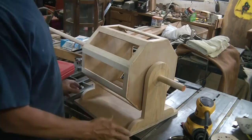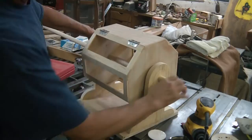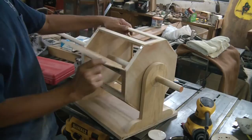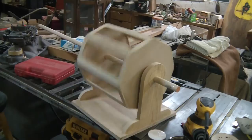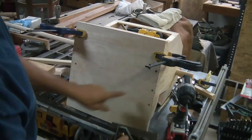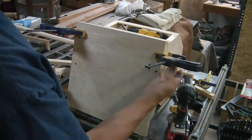Well, it's kind of like a quick look to see what it's going to look like. Still got to make a handle but it'll be glued, so you have to turn this — and these are holding perfect. Not real hard to open at all. There's a magnet in there. I went around the bottom with my combo square, just marked the center all the way down, put four screws in, and held the supports on by the bottom with these.